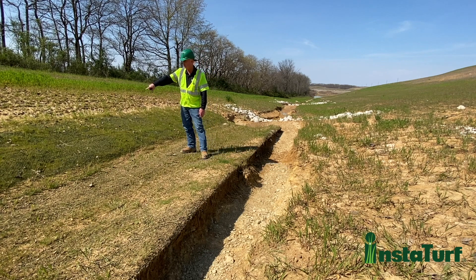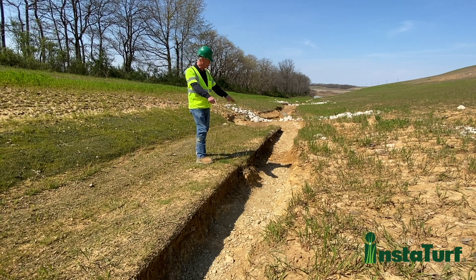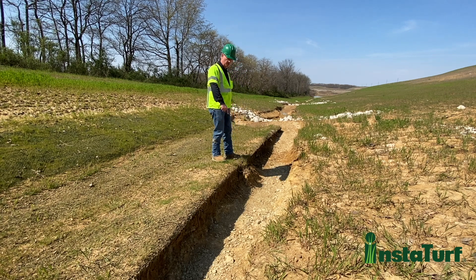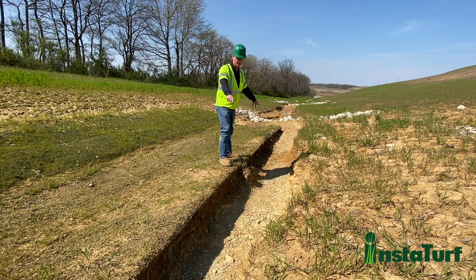You can see the left side slope here — some vegetation is starting to develop within the mat. The right side slope really took a beating, and this was a bit of an error on our part. When we did the installation we thought we had the entire flow line wetted perimeter of this channel covered with the amount of flow expected, but we were wrong — we didn't go wide enough. Where we stopped the mat, you can see quite a ledge and quite a gully that has formed right next to the protected section.